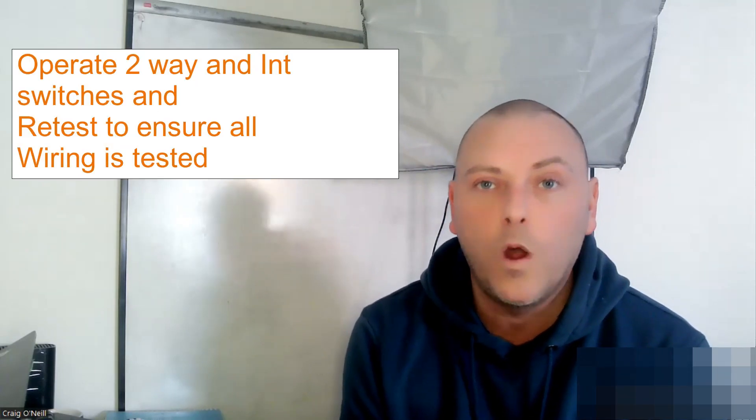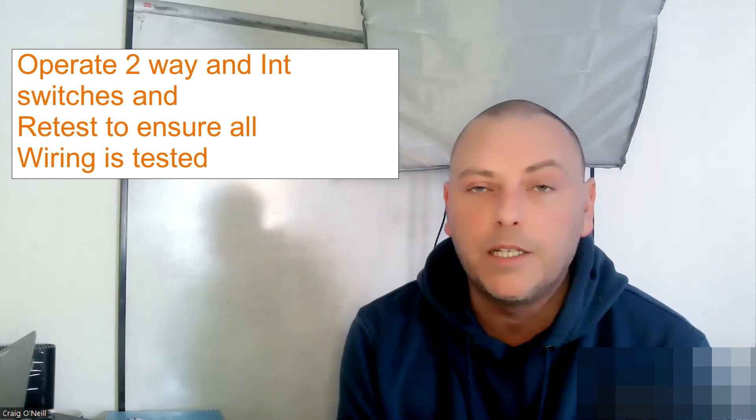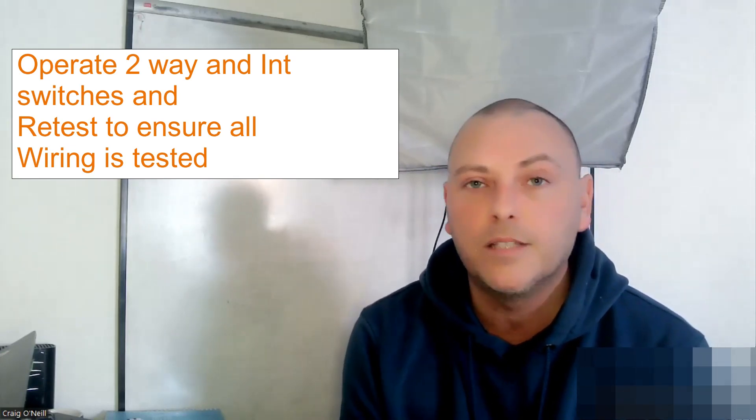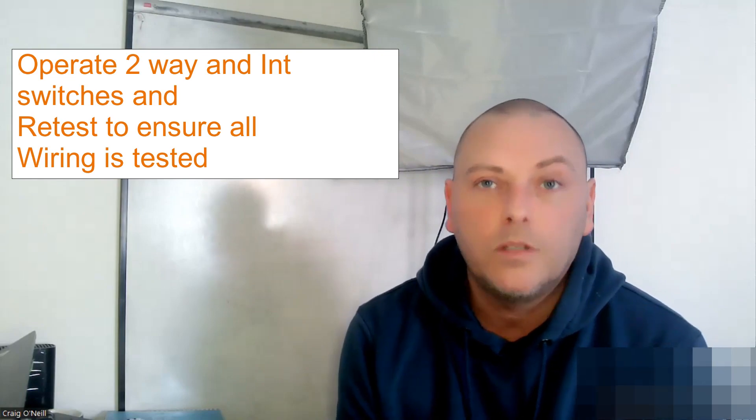Make sure it's just wiring in place only, with switches in the closed position. Ideally you can test the whole install in one go if you've got MCBs. If you've got a split-load board with two RCDs, you can do it in two groups. If you've got RCBOs, you'll have to do them individually — but leave the CPCs in and all the earthing connected; that's important. The rule of thumb is you're testing the insulation of the wiring only. The combinations are the same as safe isolation: live to earth, live to neutral, neutral to earth. For three phase you've got ten combinations.